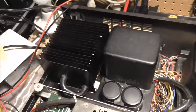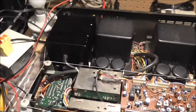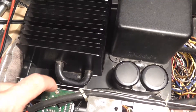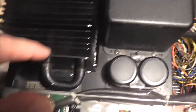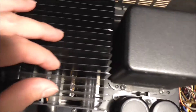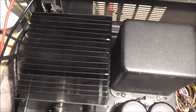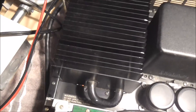I've got everything straightened out with the heatsink — just had to spin this unit 180 degrees and was able to mount the output transistors as they're supposed to be. There are some major dings on the heatsink but the Freon portion is sealed up nicely. There is actually Freon in this tube — when the outputs heat up, there's some kind of junction and it causes the Freon to move up into the fins, dissipating the heat, then it cools back and the liquid moves back down. The thing just cycles like this. I don't see any leaks and it appears to be full of Freon. I've got this hooked up to my dim bulb tester.